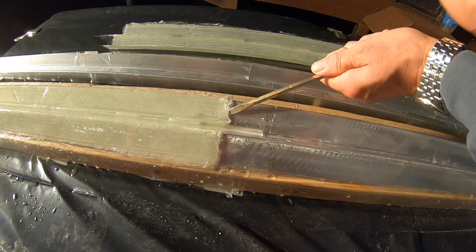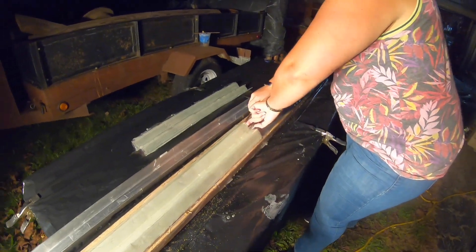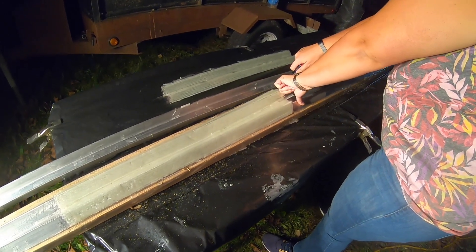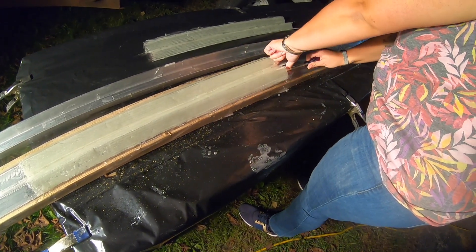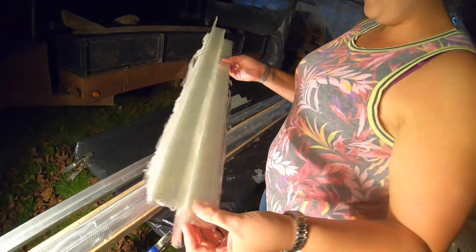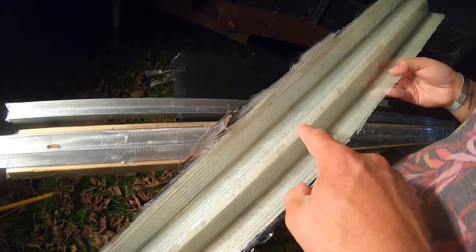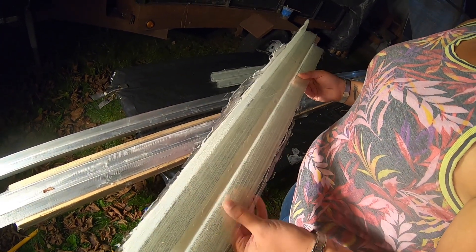It's fiberglass, it'll bend a little bit before it snaps. Get your fingers under there and just pull it however you can. Don't cut yourself because it might have sharp edges — just push it up nice and easy, gentle. Grab both sides, just straight up. There you go — looks good. It's just down the middle, that doesn't matter. These little air bubbles will get cut out anyway, and that's all going to get glassed.